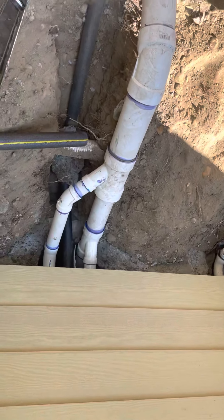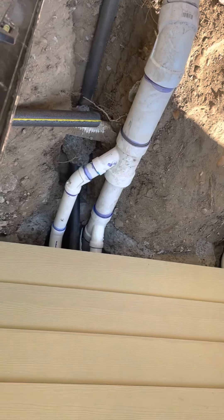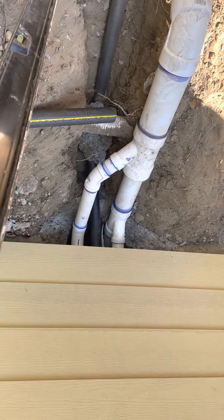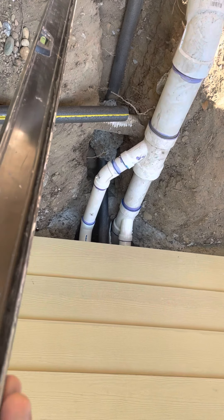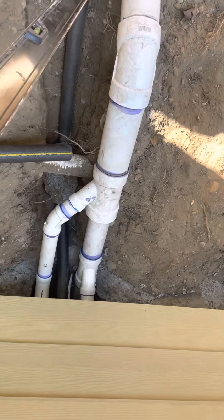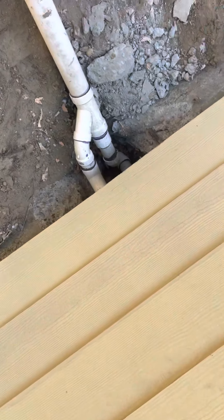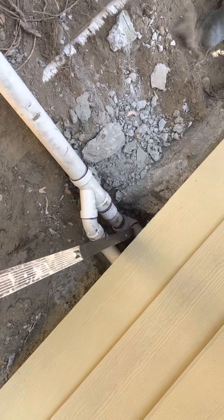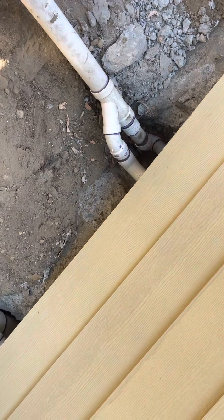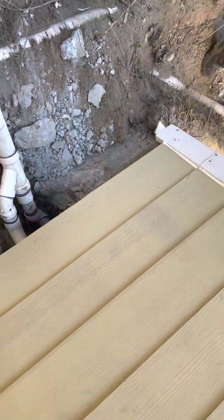Well, that's what you do when you do a conversion — you find things. I've done plenty of these in the past and when you remodel a place, sometimes you're just going, wow, why'd they put a nail in every four inches? Cause grandpa was crazy. I dig it, man, I understand that. I do know that this plumbing right here, before it sits on any concrete, has to be foamed. This has to be foamed. This has to be foamed. And that over there in the kitchen has to be foamed as well.